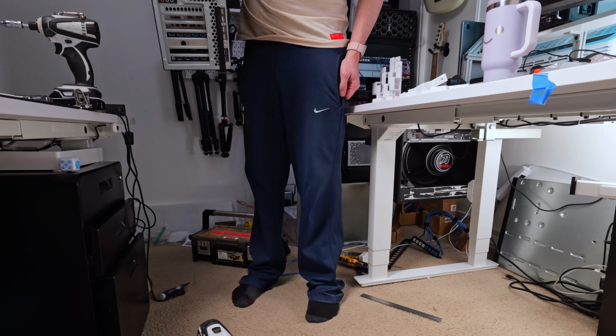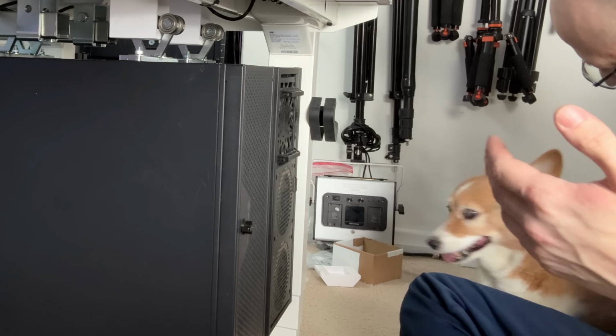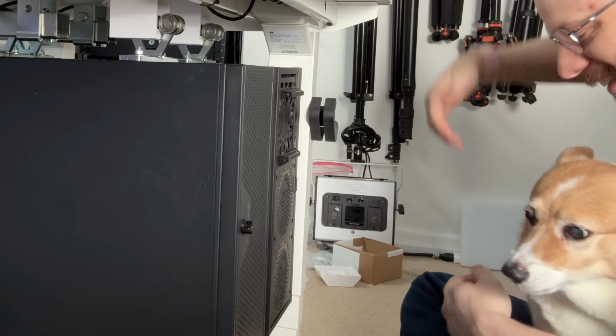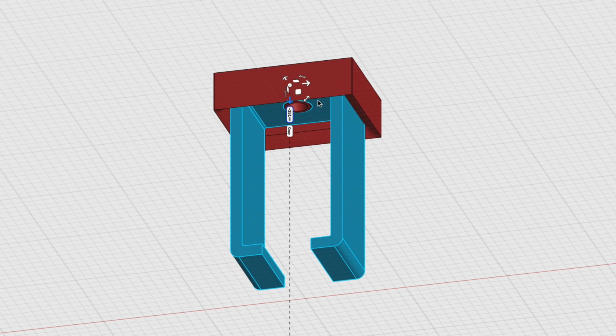So this was really tricky because of the dimensions of the tabletop, where the track hangers could be placed on the underside of the tabletop, how secure those hangers would be to basically 1/2-inch particle board. And this is where the power of 3D printing came in again. I would think I had it figured out, but then you have to factor in how much the PC can tilt before the trolley wheels can't get into the strut channel. It was a day.